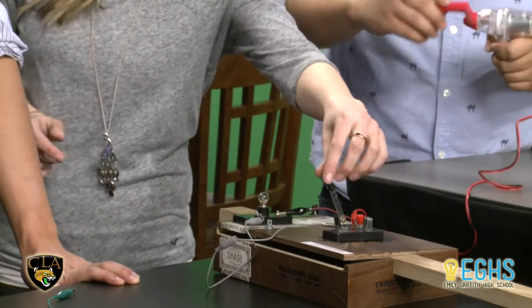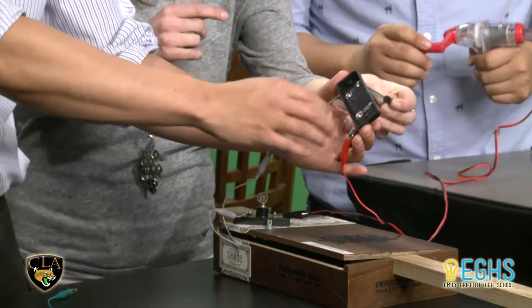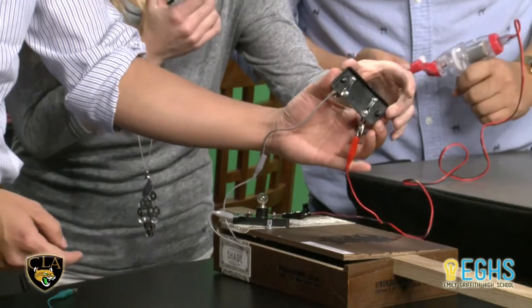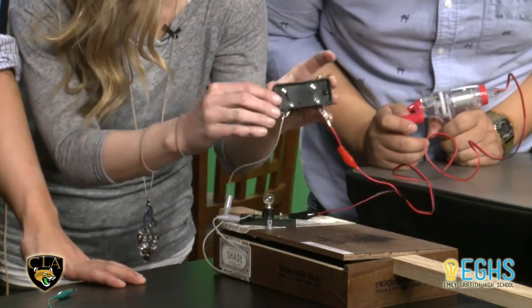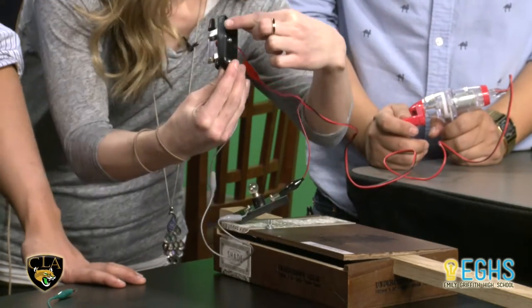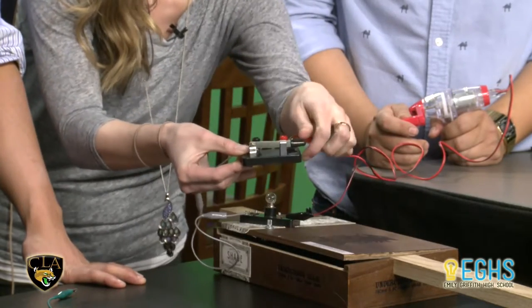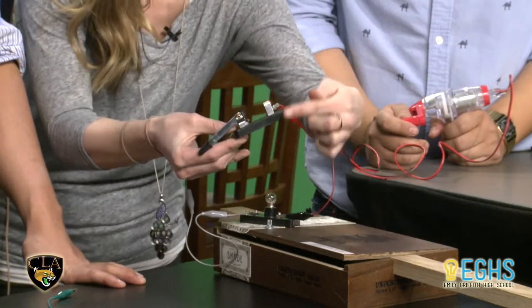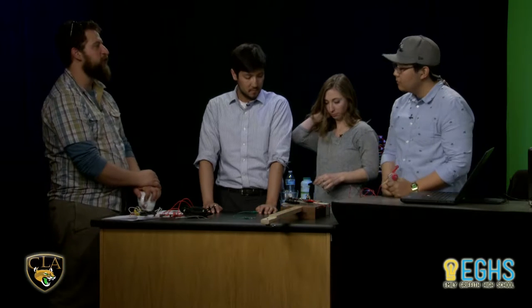And this disconnects it? Yeah, and so it's got to be connected back down here somewhere. Right, it's connecting the... Yeah, so that thing connects it. The electricity travels through the arm of the switch into the next contact point. Like down there, up there, and then into there, through there, down there, and then up to there. But if we take it off, it just goes up and then it's gone. And you know what's actually interesting is one of the things that we know is that electricity won't flow through a circuit at all if it doesn't have a path to continue.